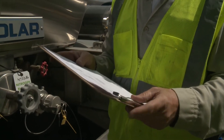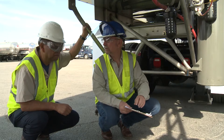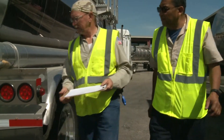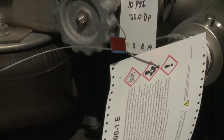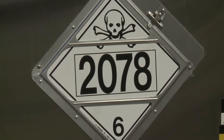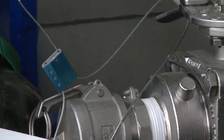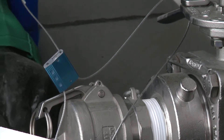Review the values of the Certificate of Analysis to determine whether the product meets required specifications. Once all the paperwork is verified, inspect the cargo tank trailer. Check the tank truck to make sure the numbers on the security seals match the seal numbers shown on the paperwork. Confirm that the seals aren't broken and have not been tampered with in any manner.